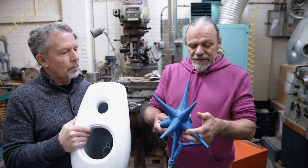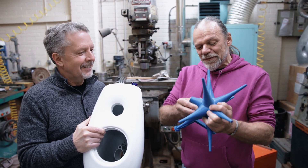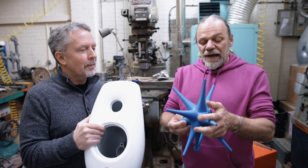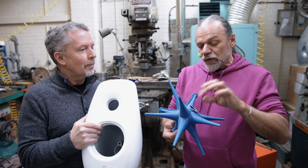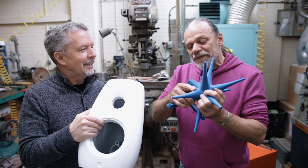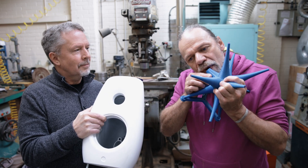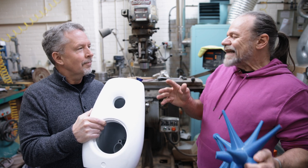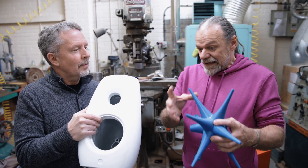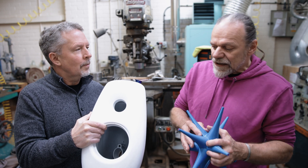This was a proof of concept — it's a dodecahedral exponential absorber array. It would have been a dodecahedron; one of the faces is a port, and another is where I did fit a small driver to do the testing work, but we don't need a driver for the final design. This sort of thing goes inside the cabinet. It's a very pure resonance — you're not getting any of that overtone stuff. The challenge of course is to get this into a practical loudspeaker, and it did go through a few stages of evolution.